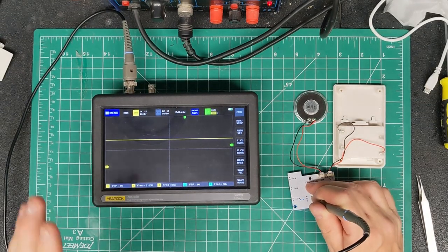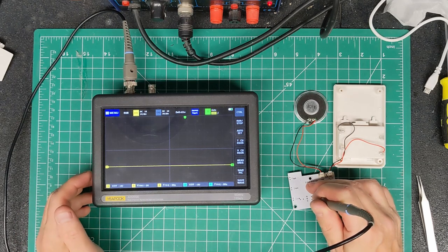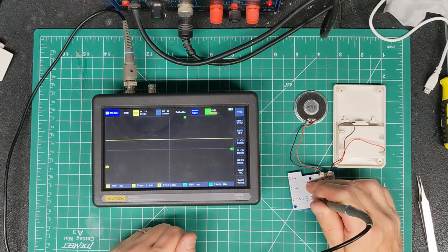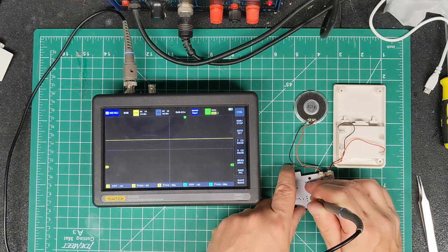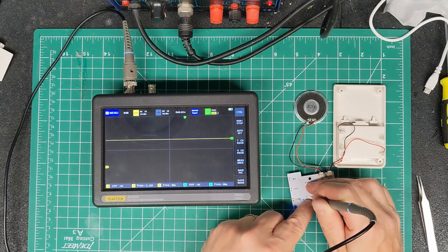This is a pretty basic rechargeable oscilloscope — 100 MHz bandwidth, dual channel, useful for hobby things like this. I've put the ground clip on the USB shell and the probe on the toggling pin. What we actually see is it sits at ground level until it triggers — I had it wrong with the multimeter. When triggered it goes high, and once the trigger is gone it turns off. The sound keeps playing because once triggered the controller plays the full sound file through. So this pin bounces between 0 and 3.3 volts when triggered.